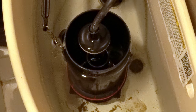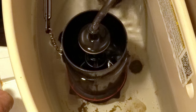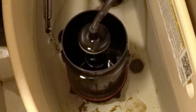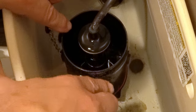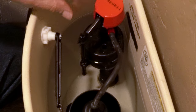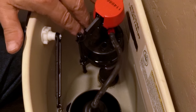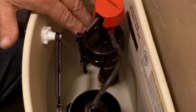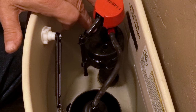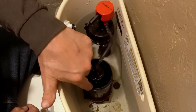So if I'm hearing that running noise, you'll hear it run and then kick back on. If you look and you see water kind of flowing over the top of the canister, that's where you need to make the adjustment. Take it and turn counterclockwise to move the float down when it's fully extended, so it will stop here instead of way up at the top. Move the float down and get that water line below the edge. If that stops your problem, put the lid back on and you're finished.